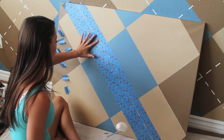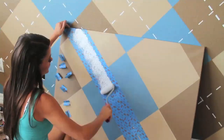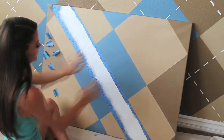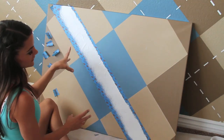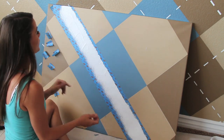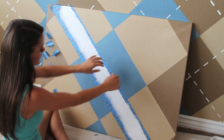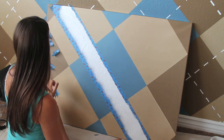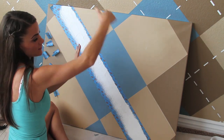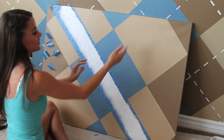With this, there really isn't any room to remove excess paint, so I recommend getting an extra empty tray and rolling your roller on the empty tray to try and get some of that excess off, and then start rolling in one direction. This is pretty much self-explanatory — it's the same as with the diamonds. You're going to do one to two sections at a time, alternate back and forth for a second coat, and peel your tape off while it's wet, peeling in the direction you put it on. Do not try to peel this tape sideways — you will be sorry. When you do your dashes, measure your center, tape all of your lines only in one direction, paint those dashes on, and then do the same exact thing starting back in the middle and do your other diagonals.